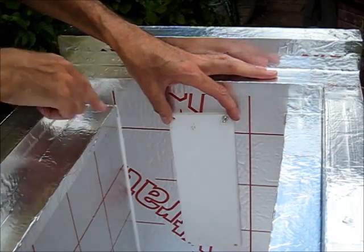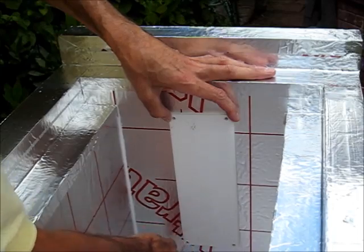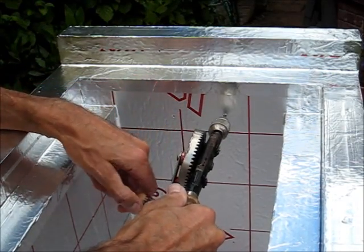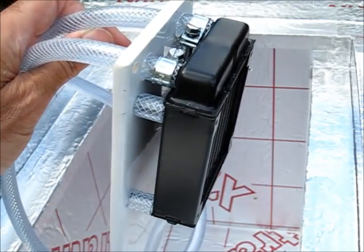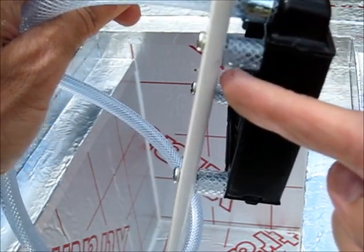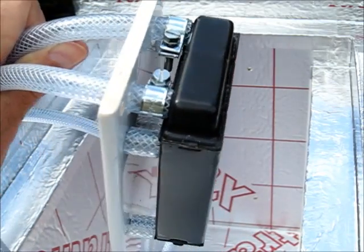This is the piece of PVC on the inside of the box — I'm marking where the holes need to be so I can drill them. I'm just puncturing through and then drilling through with a hand drill. Here's a close-up to show how I installed the miniature radiator on the PVC plate inside. I've used jubilee clips at the top, a piece of PVC tubing as a spacer, and then self-tapping screws through from the back. The fan when it arrives will mount on the front, and that whole assembly is fitted on the inside.